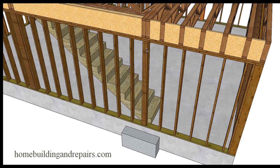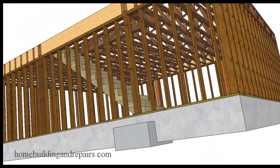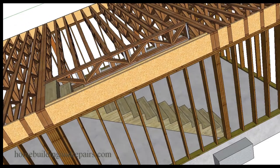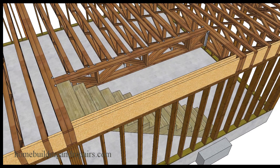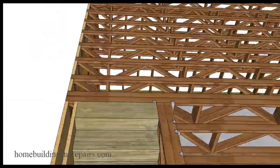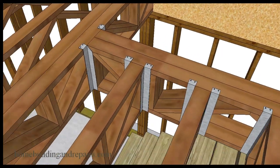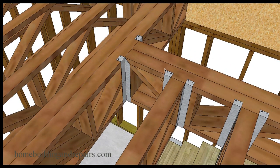We have a tripler underneath here - two or three 2x6s. You might need a 4x6 or 6x6 for something like this. Here's the footing: you might need a larger footing to support this because this is going to be a concentrated load, not something equally distributed throughout the standard footing. Top flange hangers are used for situations like this - another top flange hanger to support this.